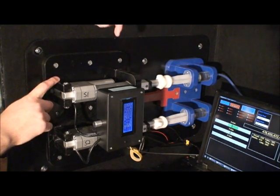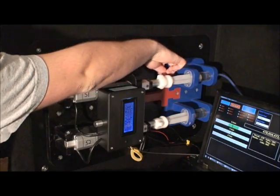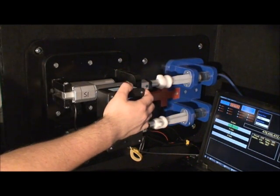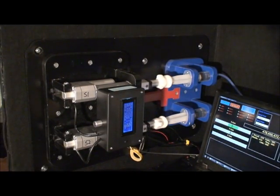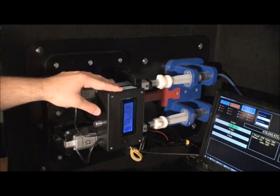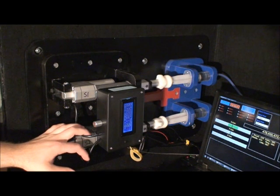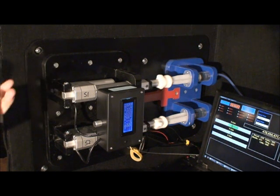Each of these parts holds the motor up on this end, then they're connected through a center red bar to keep them perfectly in line. It goes to the block that holds the actual hydraulic cylinders, which are syringes. Inside this box are two motor controllers, an FTDI to USB converter, an ATmega 328, and a MOSFET power control. The two motor controllers are for the motors right here. They also have potentiometer feedback so that the Arduino can tell what position the motors are at and know when to shut them off to stop motion.